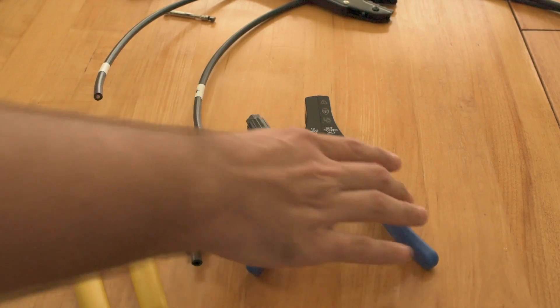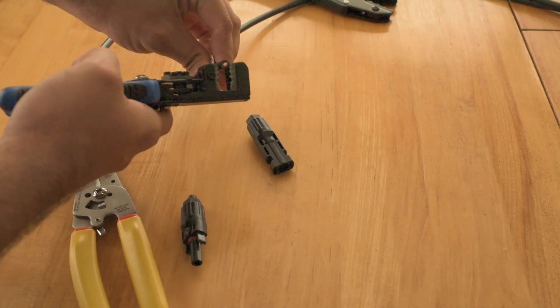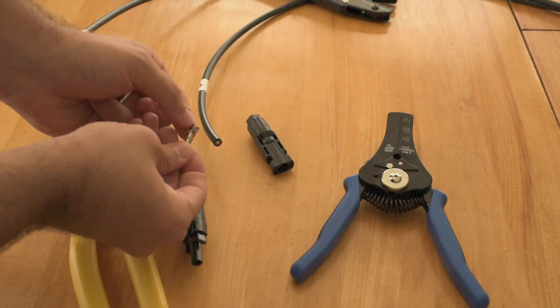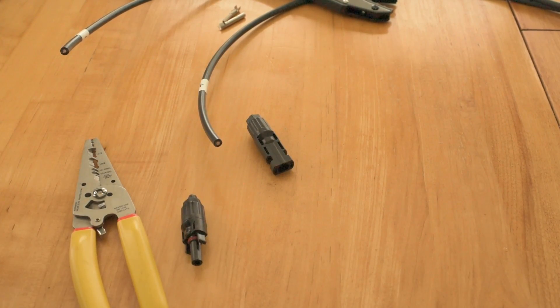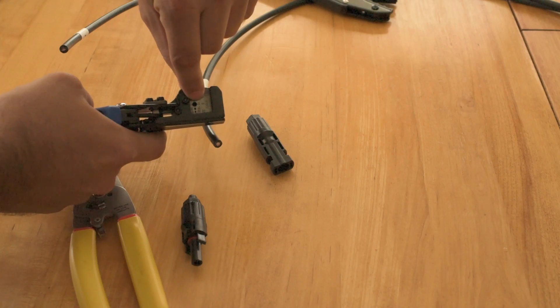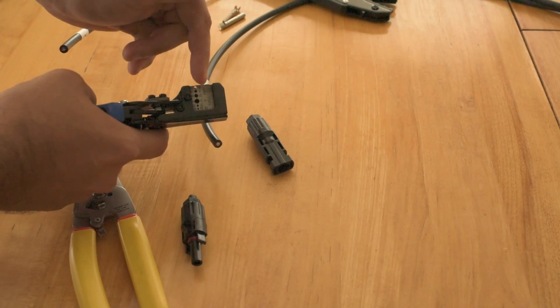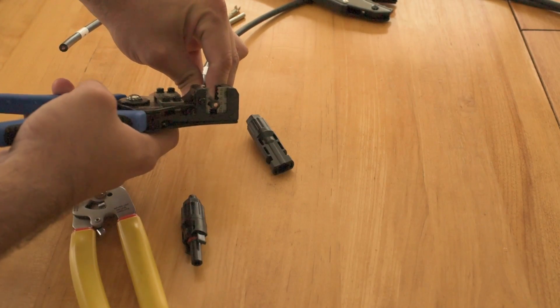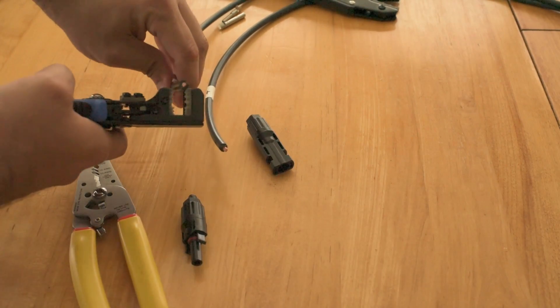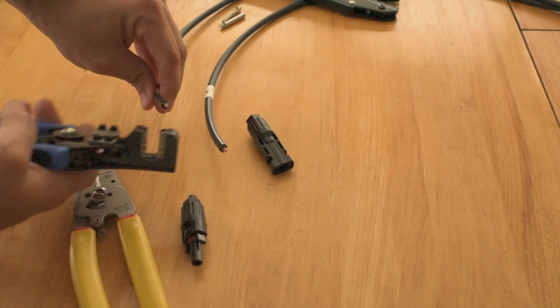The next step is to strip these wires. For this I use the automatic stripper. I only need a little bit of cable on the end — just enough to fit into the part that's sticking up. I'm not trained or certified, I'm just a hobbyist, so this might not be the industry-recommended way to do this, but it seems to be working for me. I'm going to put the copper inside this hole in the center — it's labeled 10 for 10 gauge — and that way the rest of it will cut the insulation and I'll get a nice clean strip. Look at that — beautiful, nice clean strip. I didn't damage the rest of the cable. Do the same thing over here. There we go, nice clean strip.